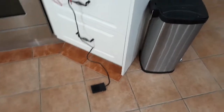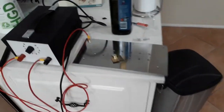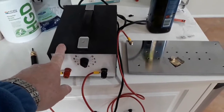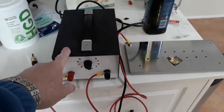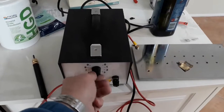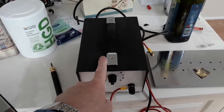There's a foot switch. Shut up Ruby — why do you always ruin my videos? So what I've got — this is called a resistance soldering unit. It's got a big transformer in it. The output voltage can be varied — shut up Ruby — by altering this. This is actually a light dimmer.